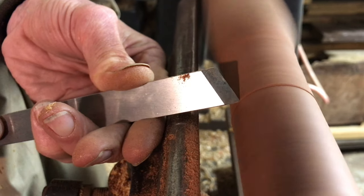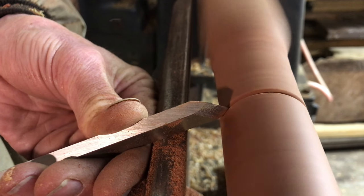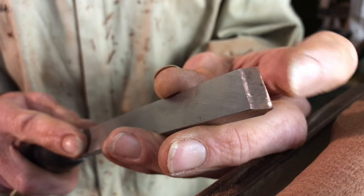The second thing you can do is cutting V-grooves, either for details or for creating a nice clean break between forms. For cutting V-grooves the tool is used differently — you roll it over so the long point is cutting into the wood. You're using that point, not the short point, nor the part in between.